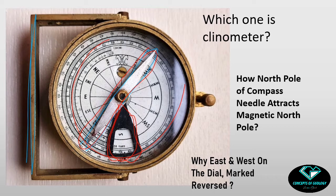The magnetic needle gives the direction, and for inclination we use the clinometer — that means the pendulum. When we combine these two instruments together, it becomes a clinometer compass: the compass gives the direction and the clinometer gives the inclination.